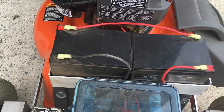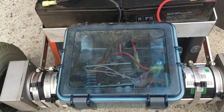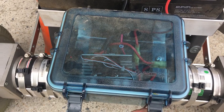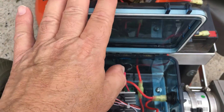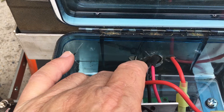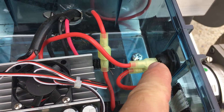Moving on down — this is a little dirty because I just finished cutting — I am using a Walmart tackle box type of box I found in the fishing department. That's a lot cheaper than the ones I used to use for my mowers; this was only like $70. I've drilled a big hole here in the back for the motor wiring to come through. I have a Radio Shack on/off switch here.